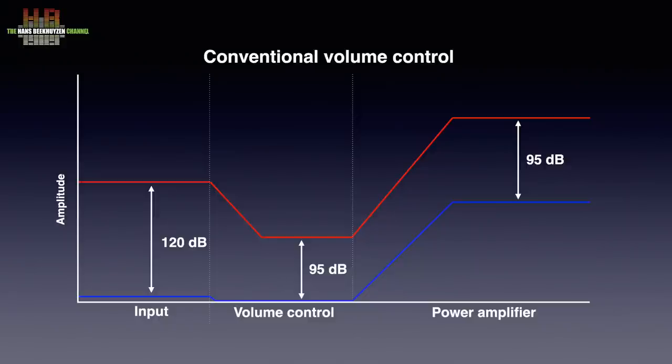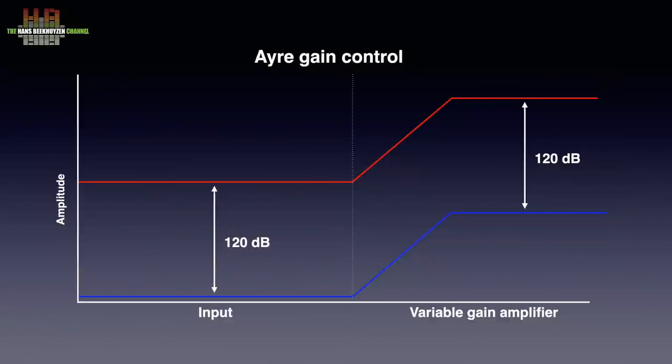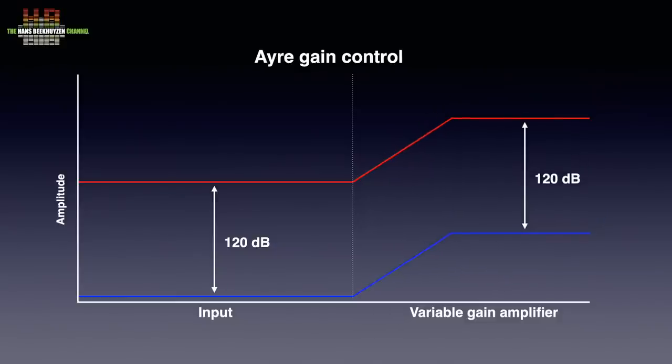You could argue that at lower levels the environmental noise in the room will be louder and thus mask the amplifier noise. But Louis D. Fielder in the seventies proved that we are able to hear signals 20 dB deep into noise. Most amplifiers work this way — but not the Air amps. When a signal enters an Air amp, it is not attenuated. This is not needed since the amp has variable gain, something that is only possible with zero-feedback designs.